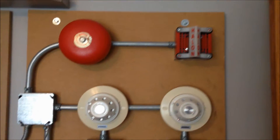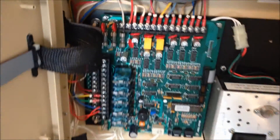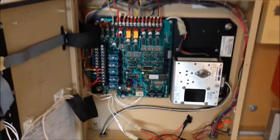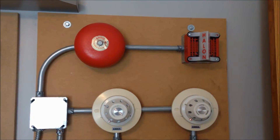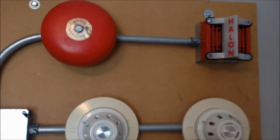This strobe is now wired for audible silence through the auxiliary output, wired back through one of the relays. I put a diode across the relay so it still does maintain the supervision even though it only activates during the pre-discharge and afterwards. That's pretty neat.